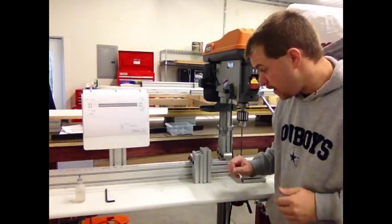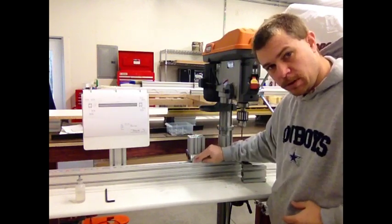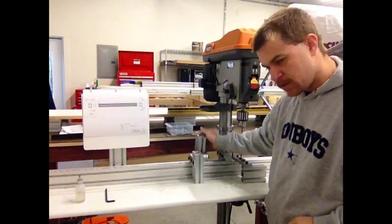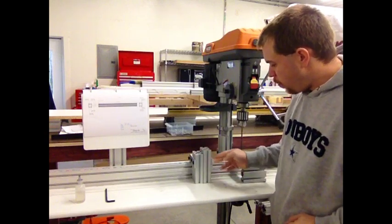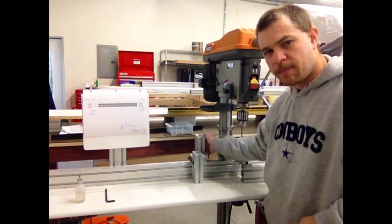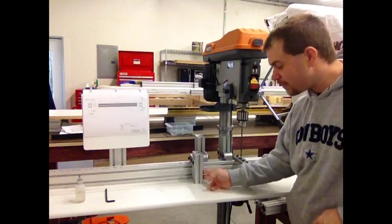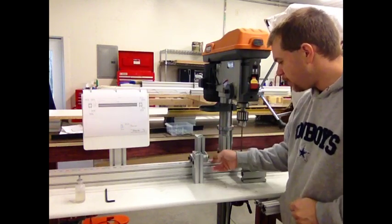Now we're back and I've made my fix. We have a double-sided nub — now two inches on the nub. What we can do now is slide our piece in, drill the one and a half, then flip up the first piece and slide it over, and this side will be exactly one and a half inches from the front.